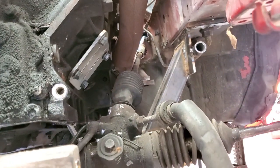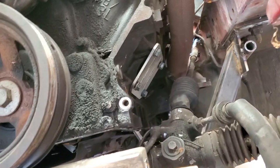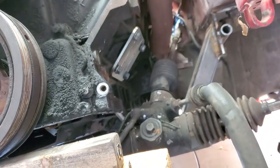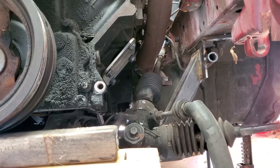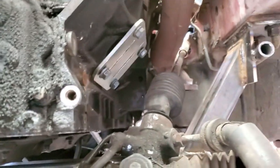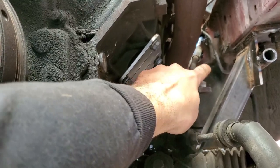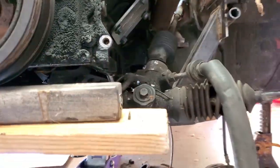As you can see, we have clearance between our exhaust manifold and our steering shaft. We have some aftermarket motor mounts that are going to work great for this application. We had to cut the mount off of one side because we need to fish the rack-and-pinion steering shaft and exhaust manifold through there, so we're going to snake the motor mount up higher and loop it over.